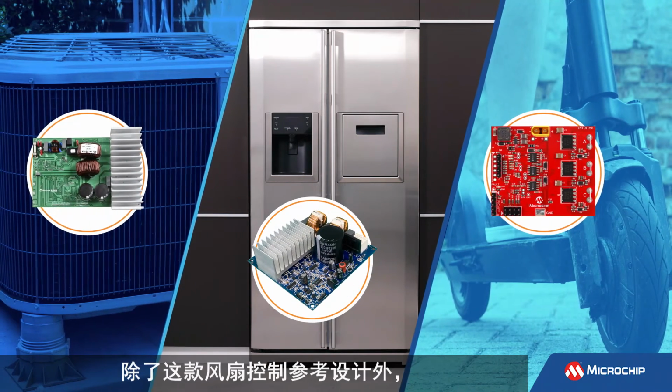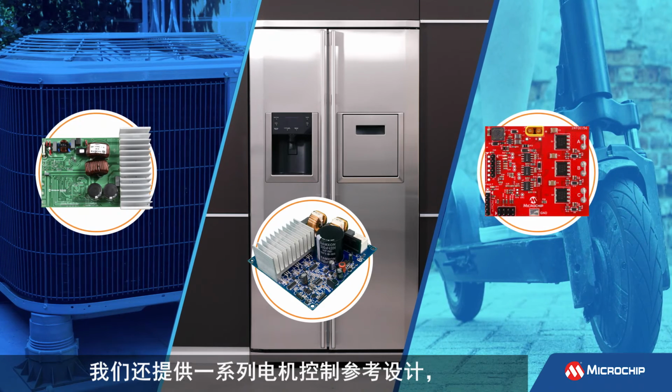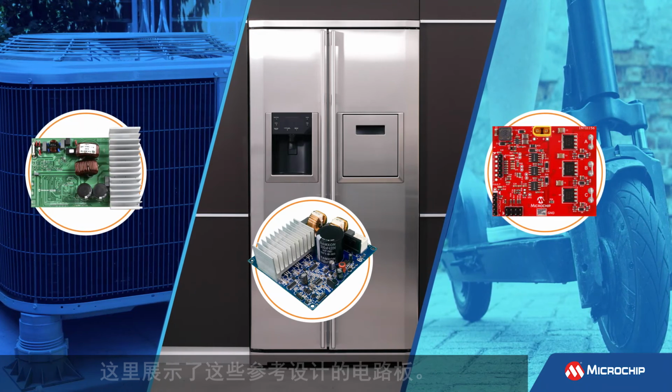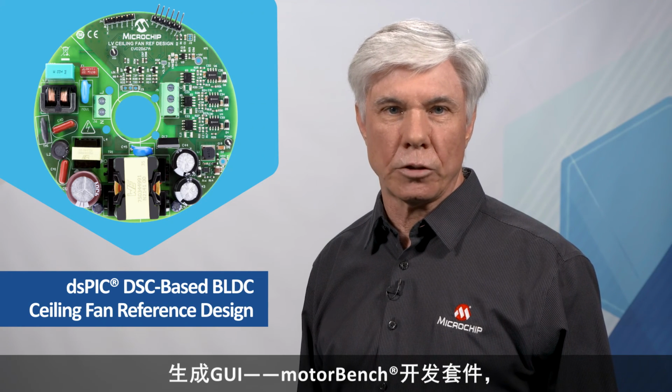In addition to this fan reference design, we offer a series of motor control reference designs, including an air conditioner compressor and fan, a refrigerator compressor, and an e-scooter. The boards for these reference designs are shown here. We also provide an array of standard motor control development boards for different motor types and voltage ranges, application note code for a variety of motor control algorithms, and Motor Bench Development Suite, our premier FOC code generation GUI, all designed to speed up the development of your prototype application.